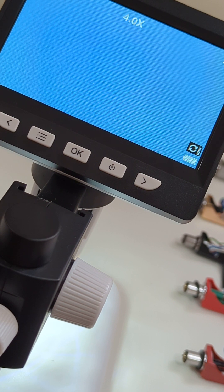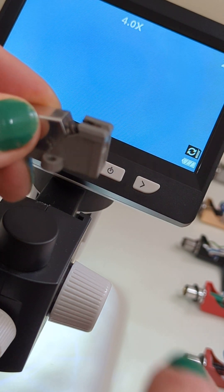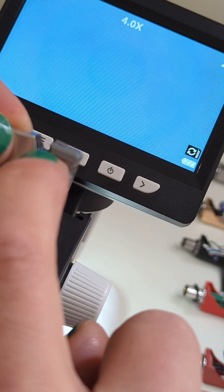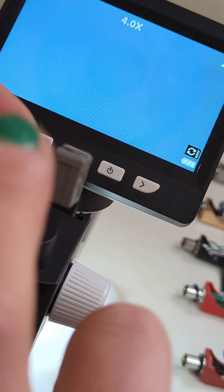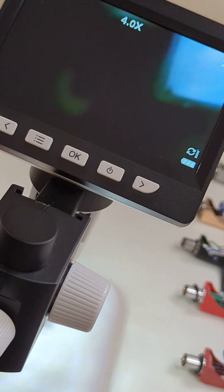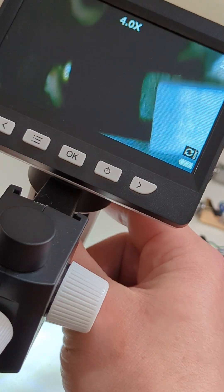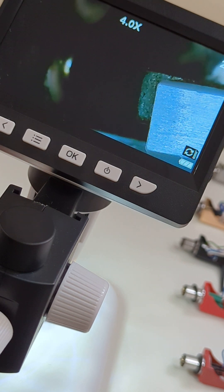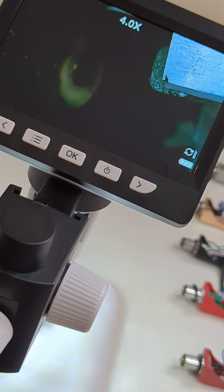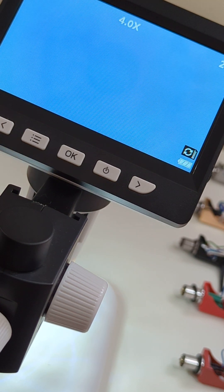Another one — this is a Grado FT Plus. That came with a stylus but the stylus was broken so I took it off. I believe it goes up to Grado Prestige or even higher — the styluses can go up the range. So you can buy that: five quid body on eBay, ninety quid stylus. Here you can see the connections inside. The black ones you can see — that was just gunk, absolutely disgusting corroding gunk — and it just took IPA alcohol to clean it. Now it's just waiting for a new stylus.